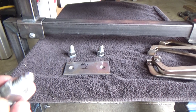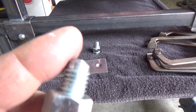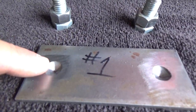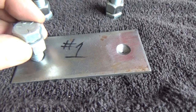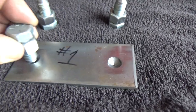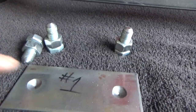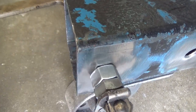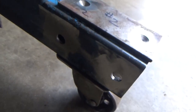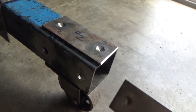I got some nuts and bolts and I machined the end at a taper — the same taper as the drill bit I used to drill the spots in there. The idea is it will go in there and retain that plate from falling out when it slides back and forth, but it also gives it a better surface area to clamp up against the slider. I've got that set up, so I'll get my MIG welder out and weld around there, then put those in and see how it works out.